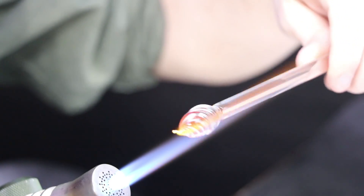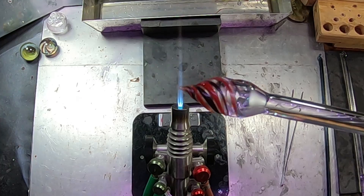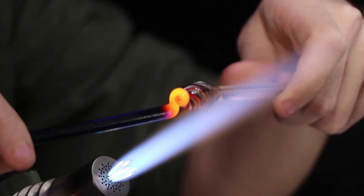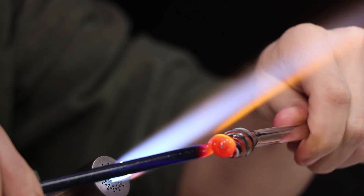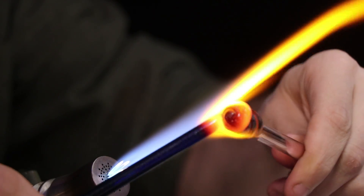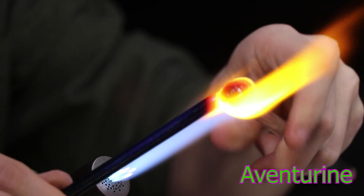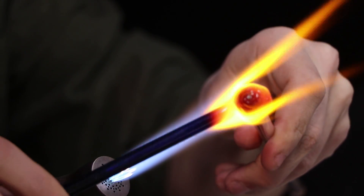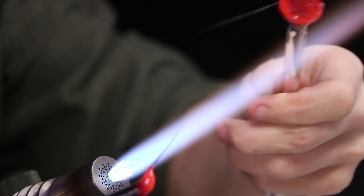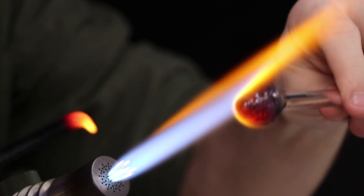Now I'm going to go ahead and pull out the end again — the termination. I want to make sure it's nice and straight. It's looking pretty good, trying to keep that cone shape. Now here is some heavy blue stardust. It's just like the blue stardust from the last chain video, but it's a little bit more saturated, a little darker. In that last video I said the blue stardust was cobalt, but I was actually mistaken — it's an element called aventurine, it's kind of like a greenish blue. I'm thinking that might be where the sparkle comes from. It's usually not very good in marbles on the inside; on the outside it's fine. It has a slightly different coefficient of expansion, so if you encase it too deeply it could crack the marble.